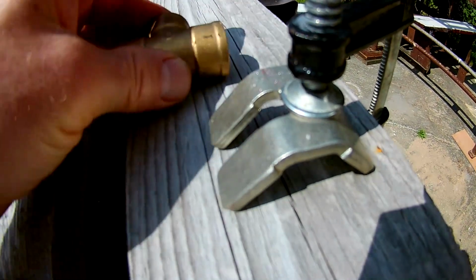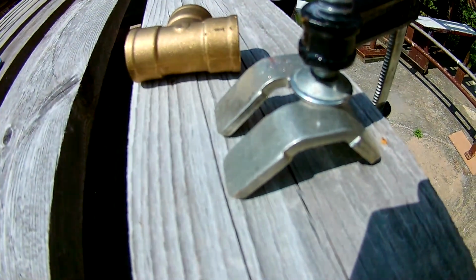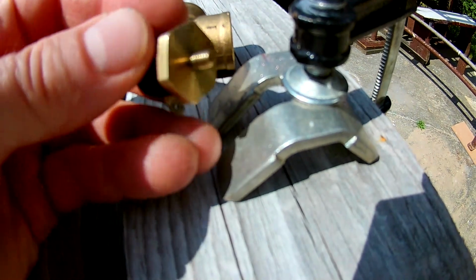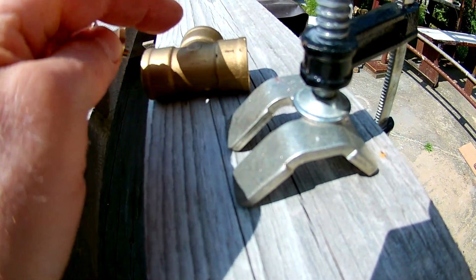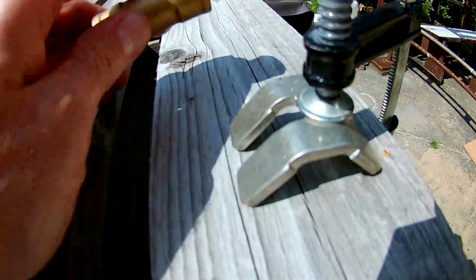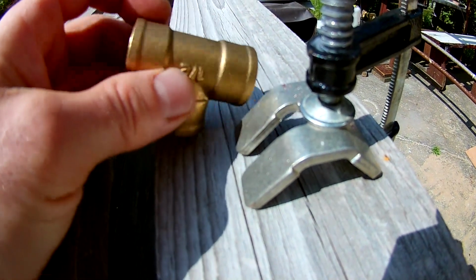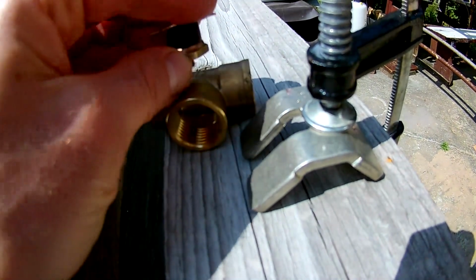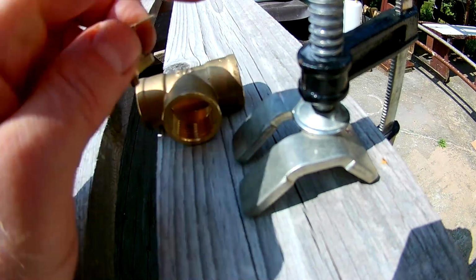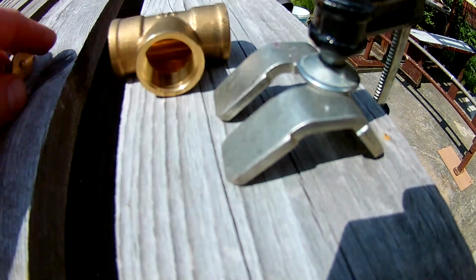So here we are going to make a very specific holder for an NTC sensor. This is the NTC sensor, which we are going to place somewhere here, and this holder will all be soldered to this T fitting, in order to sense the temperature somehow like this, but through this copper upgrade. So let's do it.